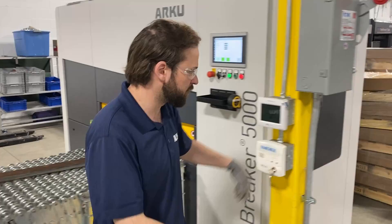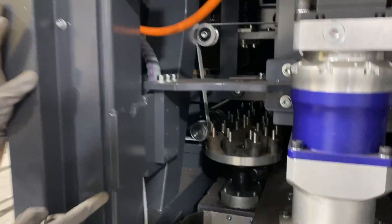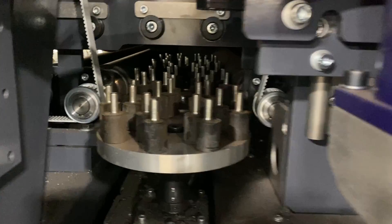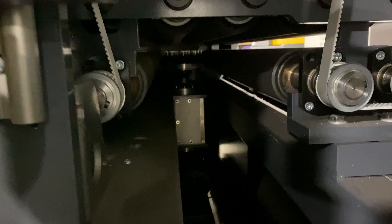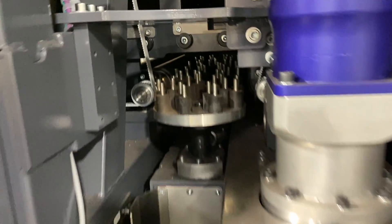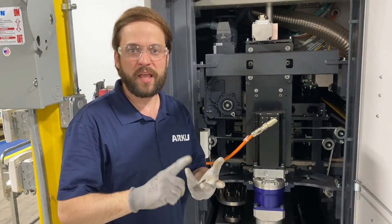So let's have a look at how the machine works on the inside. If we open this door up, you can see on the inside here we have basically various discs all the way throughout — on one side it's five, and another unit in the back, another five of them. They basically go back and forth and spin, and they have a rubber backing as you can see, so they have a little bit of give. All they do is just chip the slag right off — therefore no dust collection is needed. It's economical and these pins will last a very long time.